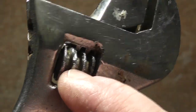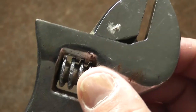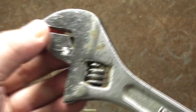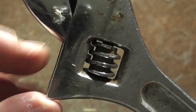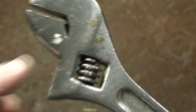I've never seen a wheel that's been that beat up where the rest of the wrench really doesn't have that much wear. The reason that's an issue is when you're using adjustable wrenches — when you turn, you actually pull towards the moving jaw, but there is still pressure. The reason they use buttress threads is so the teeth on the moving jaw can be thicker and the threads on the screw can be thicker.